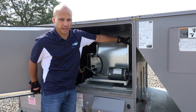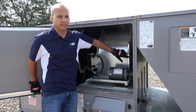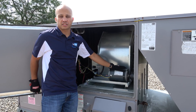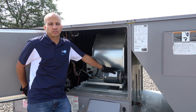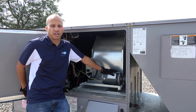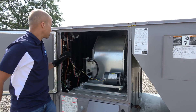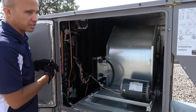The pulley here — the pulley on the back side — the motor obviously drives the pulley, the pulley drives the belt, the belt drives the other pulley which spins the blower. You will adjust these pulleys. Different size pulleys will give you different airflow. So when the system is first installed, you may have to change the pulleys or adjust them in order to get the rated airflow you want for your specific application. This is kind of the blower section. From over here you'll also be able to see a few other components.